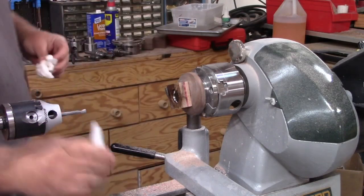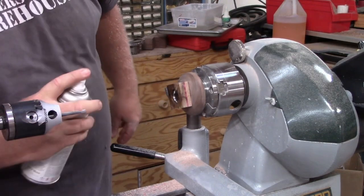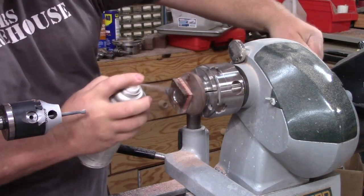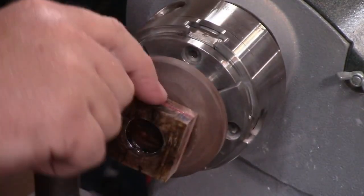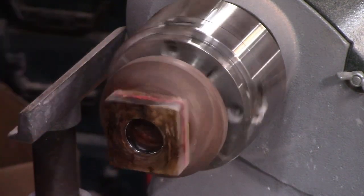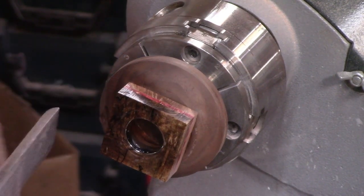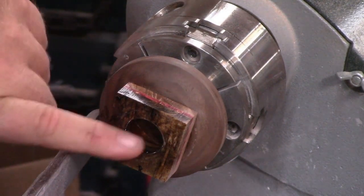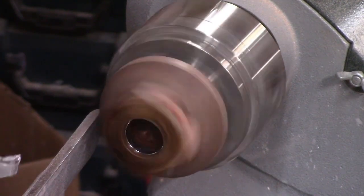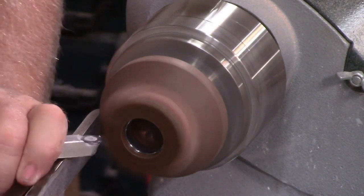Now we're ready to glue it in. I like to clean out the hole — use air or a towel to make sure there's no loose dust — then clean the ring off, make sure you've got some grooves on the outside which you can either cut or sand. I use thick CA — Mercury CA — and rotate it using the nozzle to spread the glue around so it's really flat and flush, then push the ring into the glue. With a laminated blank, you want your ring positioned correctly for how you want the look to be.